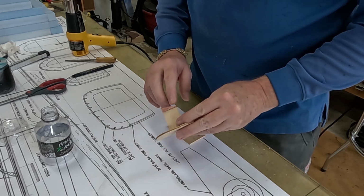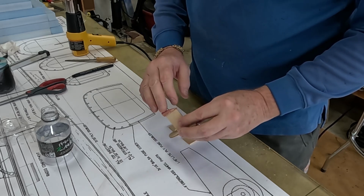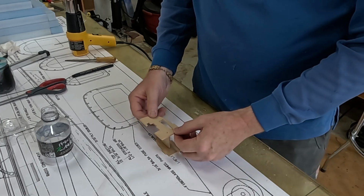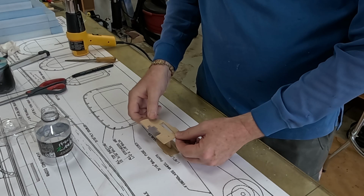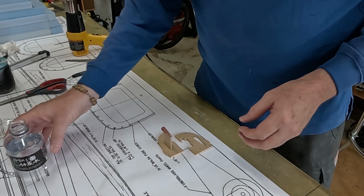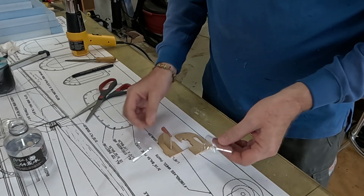So I've made a male plug. It's plywood and shaped, and then I added some body filler, sanded it all nice and smooth. It's been glued to 2 more pieces of plywood as a support, and then I made a female piece which fits over top. It's just a little bit wider than the male piece to give room for the plastic as it goes over the male form. So I'm going to recycle a plastic water bottle. I'm going to try to anyway. I've cut up several pieces of this. I don't think the molded in ridges that come originally with the plastic bottle are going to be a problem.